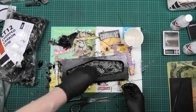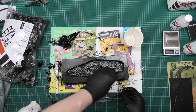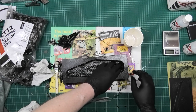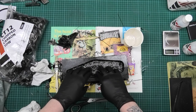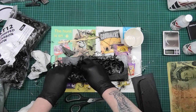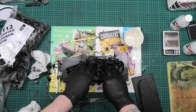A word of warning which I've learned for the future - don't skimp on infill. I thought 20% infill would be fine for pressing the mold, but I'm concerned now that it's getting hot and there won't be enough support structure to hold the heat and it might start warping things. Also, once you've got carbon out of the bag, do not put any leftovers back in because you can guarantee it'll have resin on it and it solidifies.